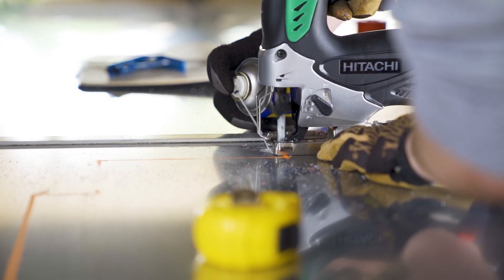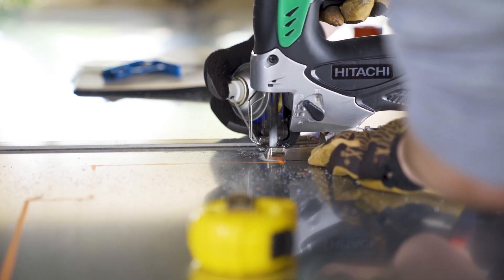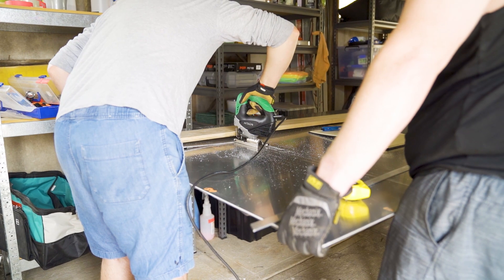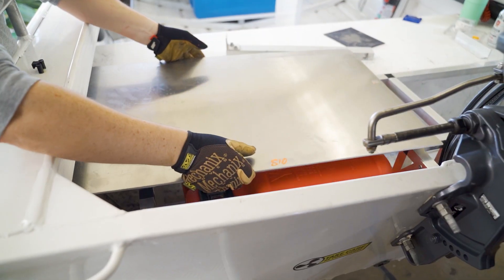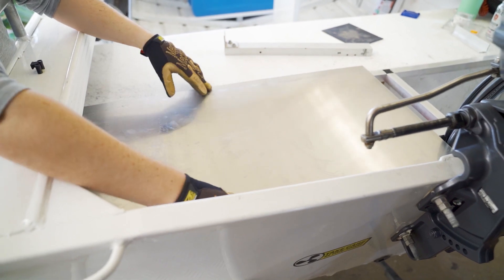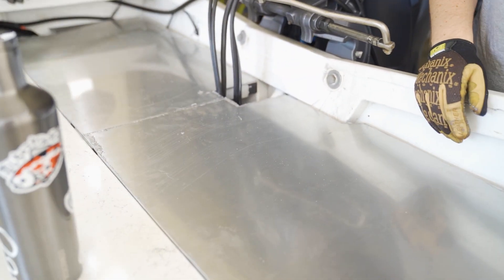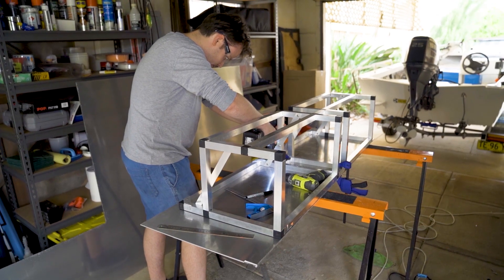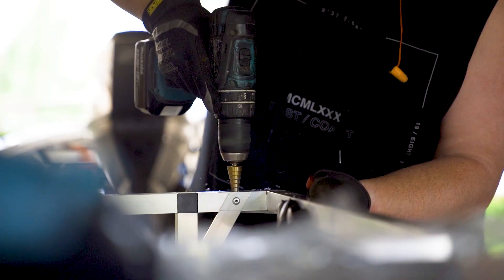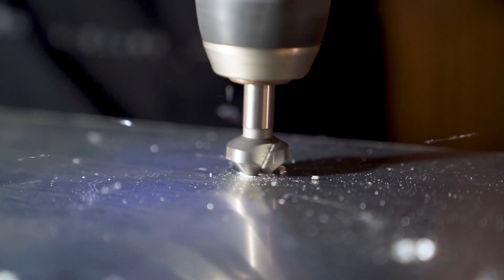My concept of building a deck that's easily removable created some really challenging issues. I want to cover the aluminium sheet with C-Deck later but hide any hinges and hardware — again, it's not an impossible task but challenging. Using a strip of ally as a guide to keep the line straight, the jigsaw definitely wanted to wander. Clearance was needed for the motor cables both at the stern and behind the console controls. To secure the panel in place and make it removable required a little bit of finessing — we used a lot of rivnuts.